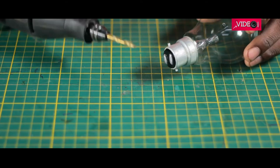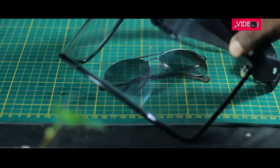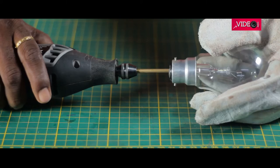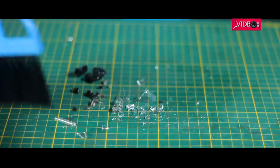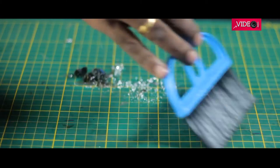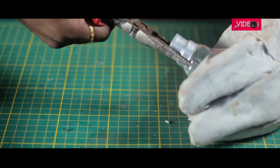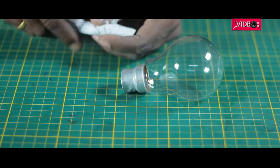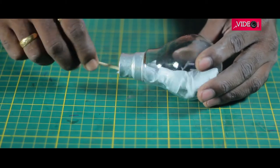The bulb needs to be emptied from its contents, but before that, hand and eye protection is a must. The drill was of less use because the bulb was sealed with a glass-like material too. A set of nose pliers did the job fine. At this point, it is good to clean and dispose of these broken glass pieces safely. You need to be gentle and delicate at every stage or the bulb could break and the whole process starts again. Once done, the inside of the bulb was cleaned with a piece of tissue rolled on a barbecue skewer.